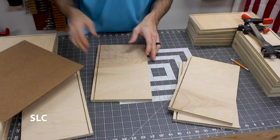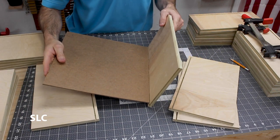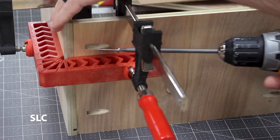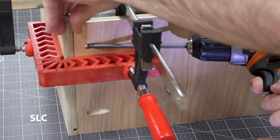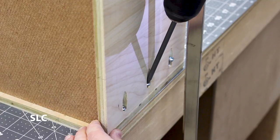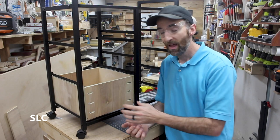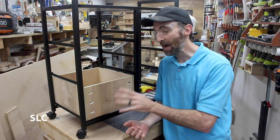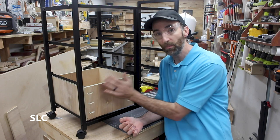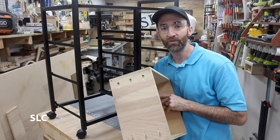Now that we have it cut out, I'm going to put everything together for the first drawer just to make sure everything fits, and then we can always modify if we have to. Sometimes it's easiest to go ahead and screw one corner together so everything starts lining up. Let's give this a nice test fit — and that fits in there nicely. The pocket screws are on the front and the back and right now it looks pretty ugly, but we're going to be putting a false front on them so these won't be seen, and the ones on the back won't be seen either.